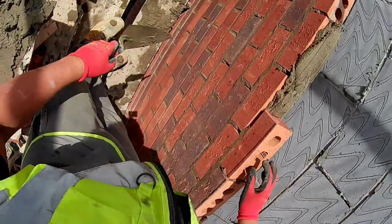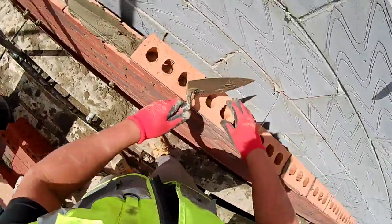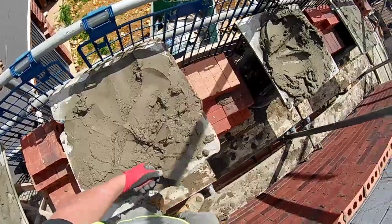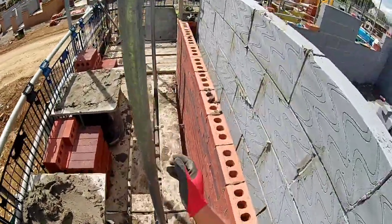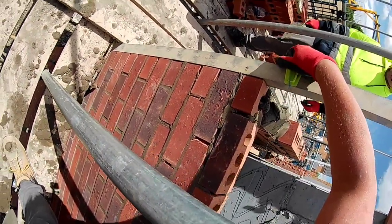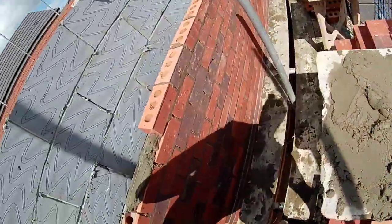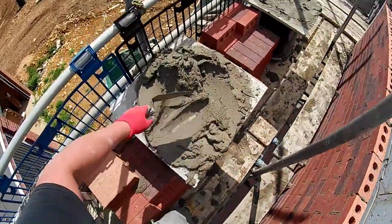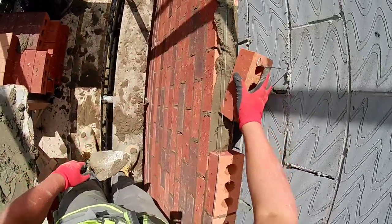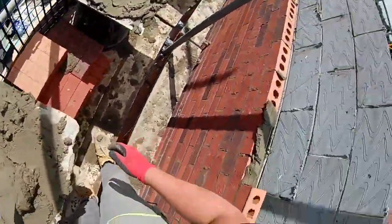It takes some practice to get used to, getting the spread right, being able to utilise the 7-inch trowel. A lot of people just can't do it. You see people pick a 7-inch trowel up and they look awkward with it in their hand, but it takes some getting used to. I don't really see anyone use it other than Charlie Collison, really. Not a lot of guys are advocates of the little baby trowels, and I know Andy at Bricklaying Worldwide uses it with a bucket.